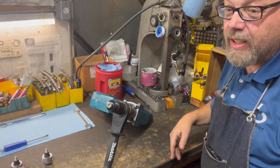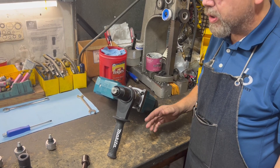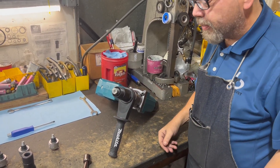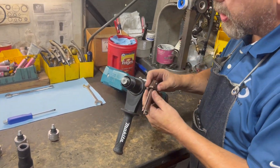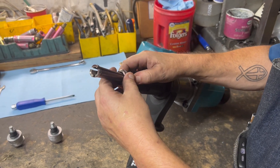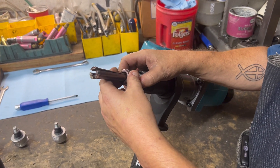We've got a Makita BV17 — 17,000 pounds of pulling force. We're going to set up a 12 millimeter bobtail nose on here. We're going to start with the inner puller: you want to screw it all the way down and have it bottom out. It may take just a moment — there are quite a bit of threads.